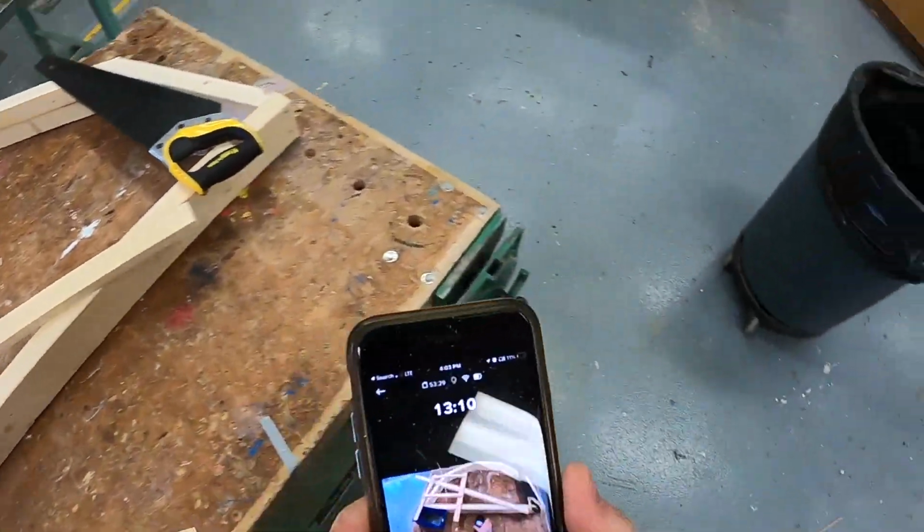So on the back of every measuring tape, there is a little plus blank on there. This one says plus 2 3/8. So if I put the edge of my measuring tape right there, go across to the other side and lock it down, that is 1/16 shy of 8. So 8 plus 2, 8, 9, 10, plus 3/8. All right, 10 and 3/8, minus 1/16. So 10 and 1, 2, 3, 4, 5 sixteenths. So I'm going to, on a piece of paper, write down 10 and 5 sixteenths.